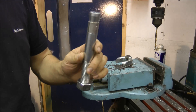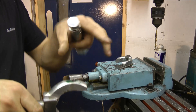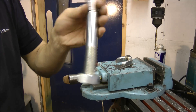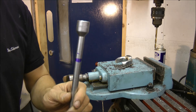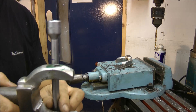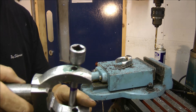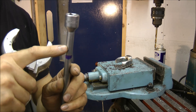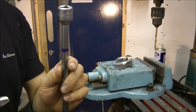Being a cheapskate, I was going to use this old bolt to form the top piece for the steering attachment. I got that off a car boot sale for a pound — it's okay, isn't it? But while I was there last week I found this. I use these on my tapping machine, so I think that will be cut down and will form the steering control. I'll just need to machine that to 9mm and then step it down to 7mm. It has to be pretty accurate for it all to work.